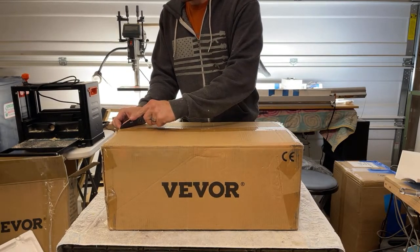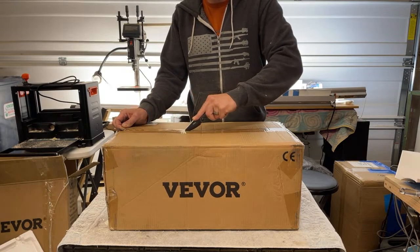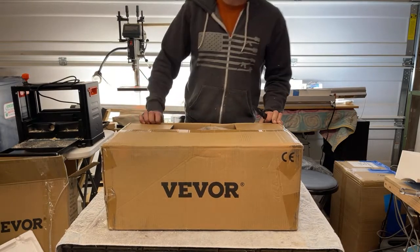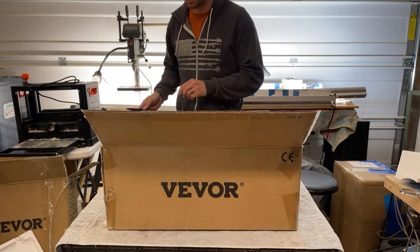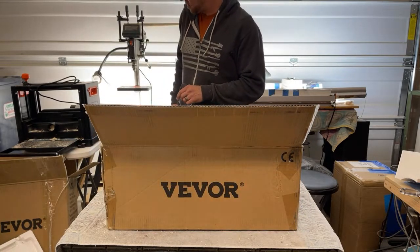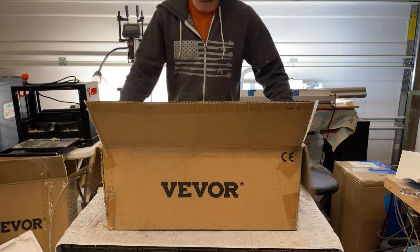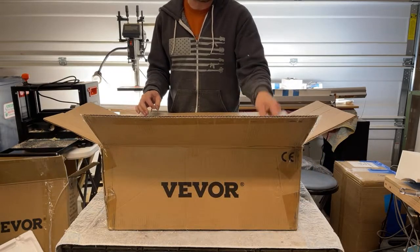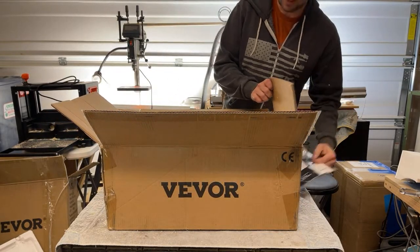So that left me with 2 3/16 pieces. And I probably took off about 1/16 of an inch, which pretty much took care of any saw blade marks. And so that's about perfect. I don't think you really want to go, see, 5 millimeters is about 1/4 of an inch, and I don't think they sell fretboards thinner than 1/4 of an inch. So you wouldn't want to go thinner than that anyway. All right.